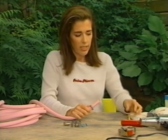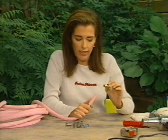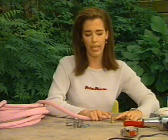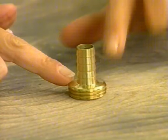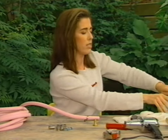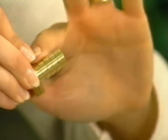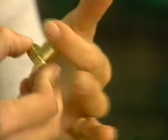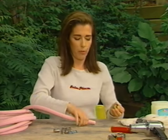On it goes. Then you take this nice little brass fella here and you slip it right inside the hose. You can see the way it's made is with these little flanges so it's going to grip really well. If it's a cold day out you might need to put a little Vaseline on the brass piece so that it slips inside really easily. And if that doesn't work, I've been known to use a hair dryer to make the plastic more pliable.